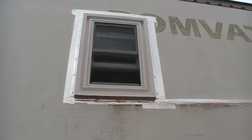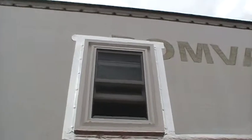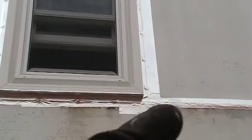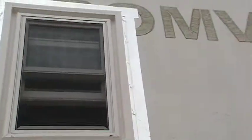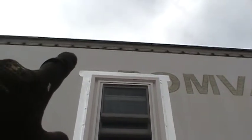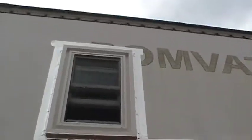Hey guys, welcome back to the off-grid project. Outside the trailer, as you can see, I got a window in — actually both of them. What I did was put one-inch galvanized screws in the nailing edge all the way around. I did the bottom first with aluminum tape, then the sides, and then the top, so if rain ever hits it, it travels all the way down without getting in and leaking. I'm also going to fold a piece of sheet metal above it, probably a couple inches past on each side, deflecting out three inches, and that will divert a lot of the moisture too.